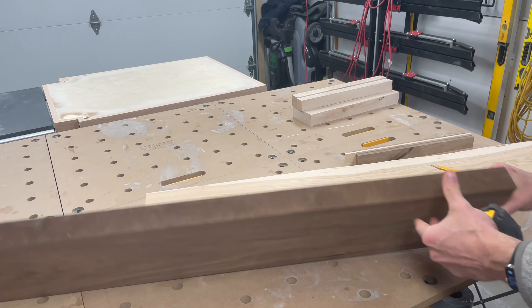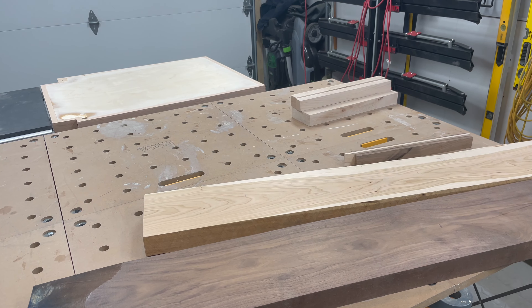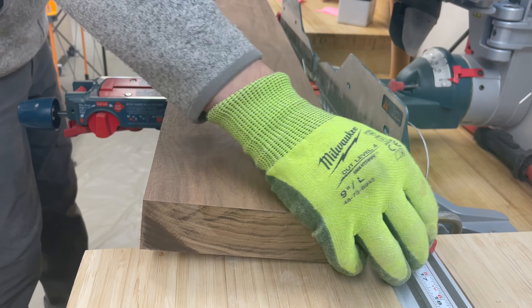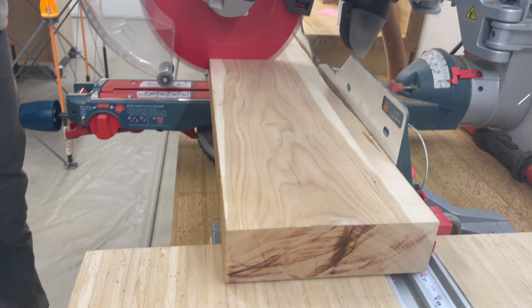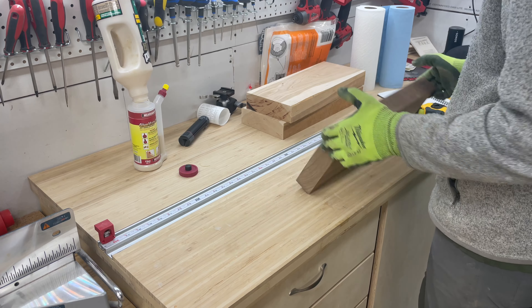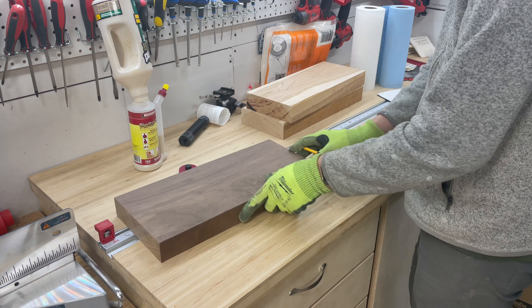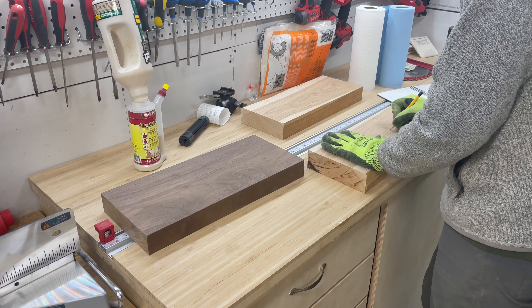The first step is to roughly lay out our cuts. I want the cutting boards to be about 14 inches wide, so I'll mark and cut these at 17 inches. This gives me room to play with during glue up so the ends don't need to be perfectly aligned, and it lets me trim off any snipe I get when planing. I use the miter saw to break down these pieces. The boards are decently square and flat, so I use the flat surface of my miter station to check for a flat face, then mark the flat side facing down for the next steps.